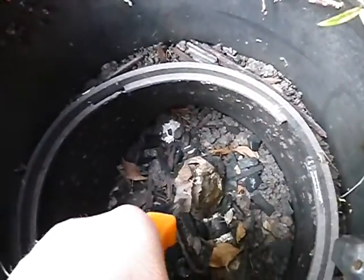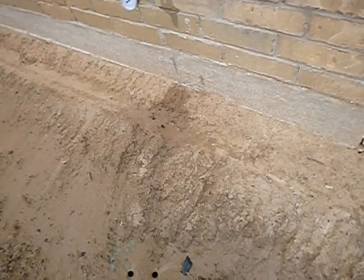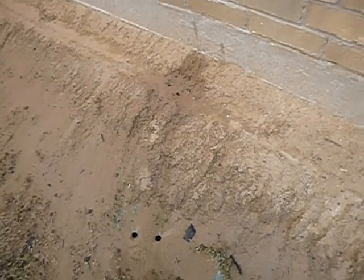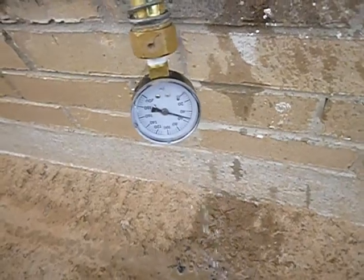Don't want that. This is your pressure reducing valve. And that's a good thing. It's also a check valve that keeps water from going back into the house. And I'm going to leave this open. I want to get a picture of that mess. Not a big mess. Coming along, that's your clean outs, double clean outs. We're looking for between 40 and 80 PSI. 50 is on my mind because I've already, spoiler alert, so we got about 50 PSI, which is fine.